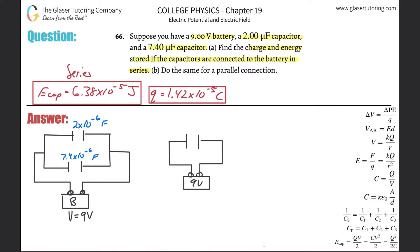How do I know it's parallel? I imagine something flowing from one side of the circuit. In order to get to one capacitor, it does not have to flow through the other — the flow can go through both of them simultaneously. That's a parallel arrangement. Whereas in the series case, to get to the second capacitor the flow had to pass through the first one. That's how we know the difference.